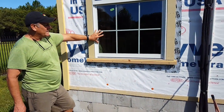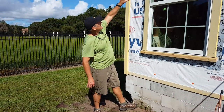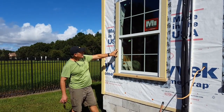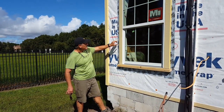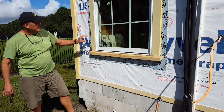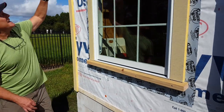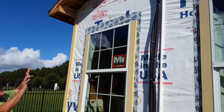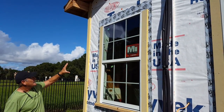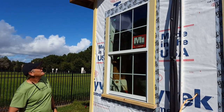You can see that again, we've already talked about our very, very high energy-efficient windows. All of that, once it's installed, is glued and screwed back to the sheathing. Then we use this peel-and-stick tape that makes a completely airtight component around the windows. We have a very neat technique that we do over the top to make sure that the tape is counter-flashed, to make sure water can't get behind it and onto the plywood.